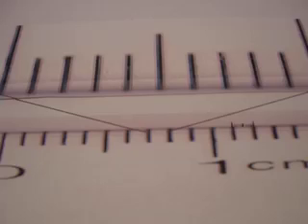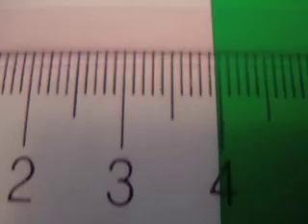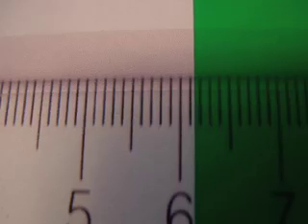Each of these little lines on the ruler are divided into ten more spaces. In your head, you need to imagine that each little millimeter place is divided into ten more places. Here you can see that the measurement is a little past the 2.5, and you might call it 2.55. Remember, this reading needs to have two decimal places. You could be lazy and call it 4.00, but if you look carefully, it's a little before the 4.00, so you would call it 3.96 maybe. This one is a little beyond the 6.1, perhaps 6.13.